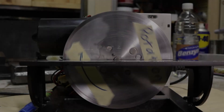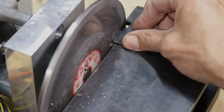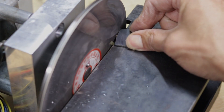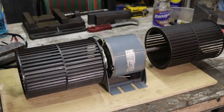Part 2: some form of rotational device. Now, for diamond grinders, I've read that slow speed is best — somewhere in the region of 200–300 RPM for a 6-inch wheel like I'm using. So to get that speed, you really have two basic options.